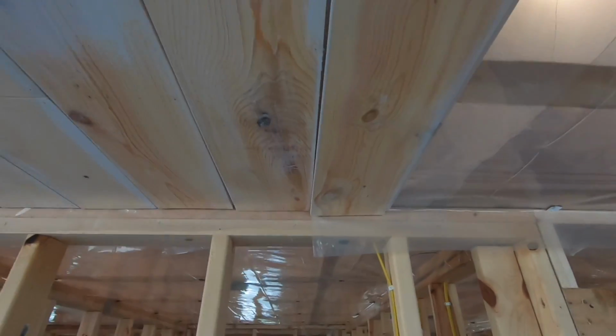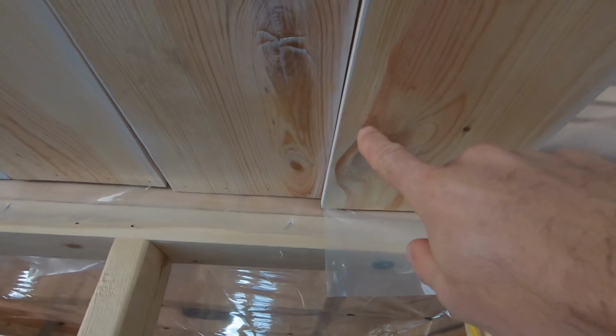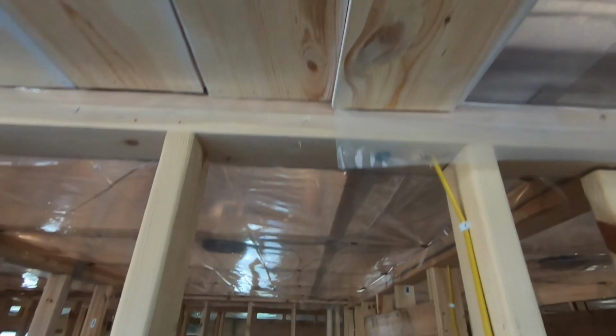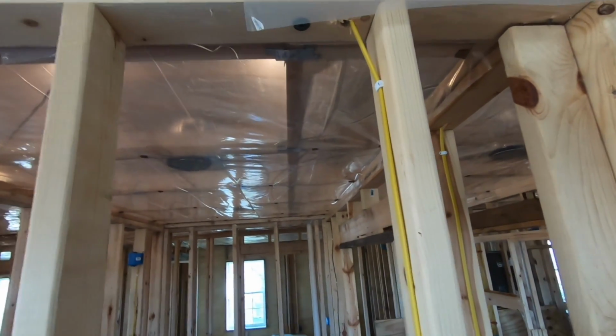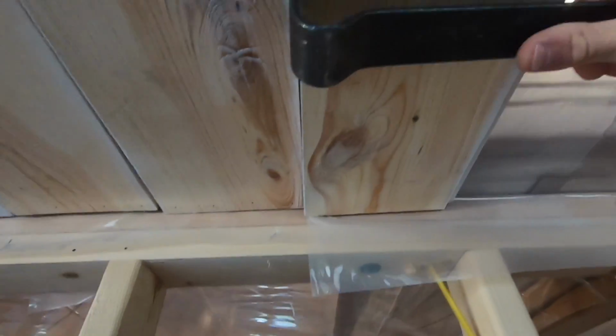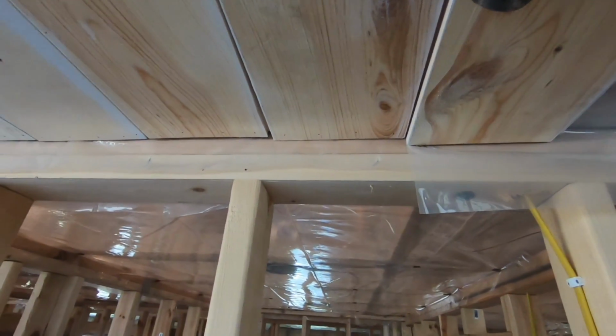All right, I'm putting this board up, guys, and this is one instance you're going to come across, when the board is a little bit warped and it angles towards your others. This one's a little bit easier. You just take your little crowbar. This is going to be difficult holding this camera, but get your crowbar up in there, and then you can just pry it over.